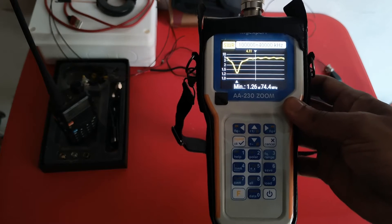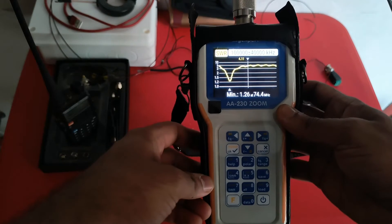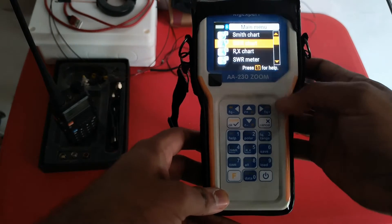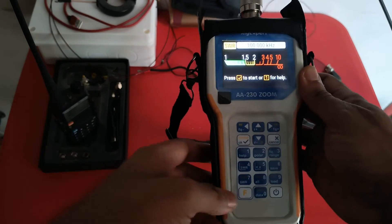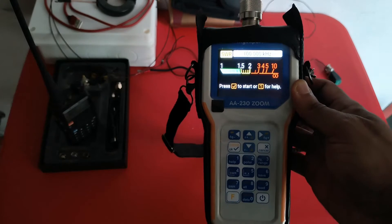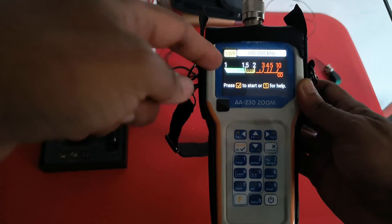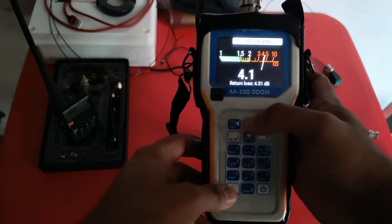Let's say that we want to bring it to 100 MHz. So we want to go from the lower frequency to a higher frequency, and we need to shorten the antenna element length. We'll start the SWR2Air feature and then go outside with our handy tuned to 145.150 — that's the SWR2Air frequency we set — listen to the burst, and set the dipole length based on the feedback. Then we'll come back inside and check whether we have tuned correctly.